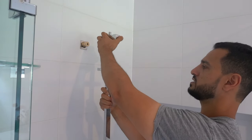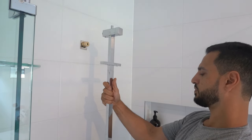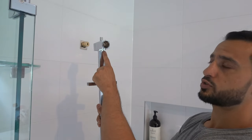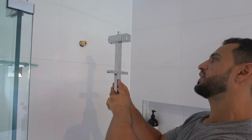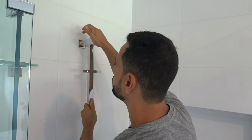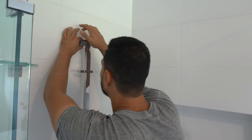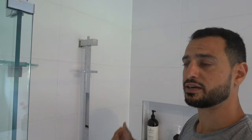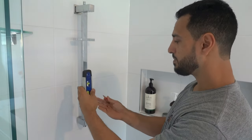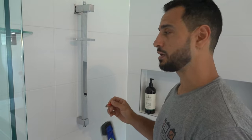Depending on whether you want the hose on the right or the left, rotate it to your preferred position. Once you're happy with that position, square everything off and retighten these grub screws. Then drop the cover plate straight over the top and push this fitting through — you might feel a little resistance because of the rubber seals, so just take your time. Take a level, drop it on here and make sure everything is nice and straight, then mark up to drill the bottom fitting. Once you're happy with the position, take a pencil and mark out the perimeter around the fitting.